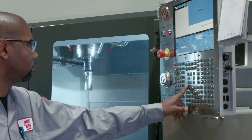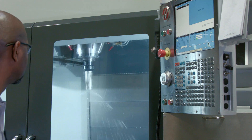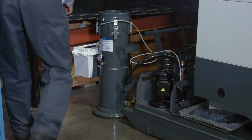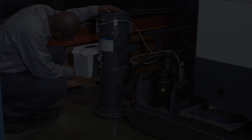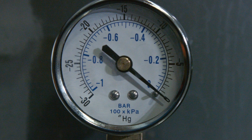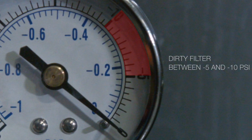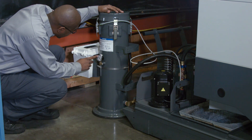Now Orville activates the coolant system again to pressurize the auxiliary coolant filter tank. He returns to the back of the machine to check the filter gauge on the ACF tank. This will tell us whether the system is flowing freely or if it's plugged up. When the filter bag is clean, the gauge will read between 0 and minus 5 PSI. But if the filter bag is dirty, the gauge will read from minus 5 to minus 10 PSI. It's clear we have reduced coolant pressure here, so let's change the bag out.